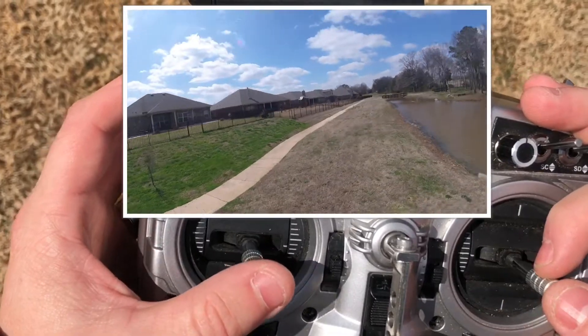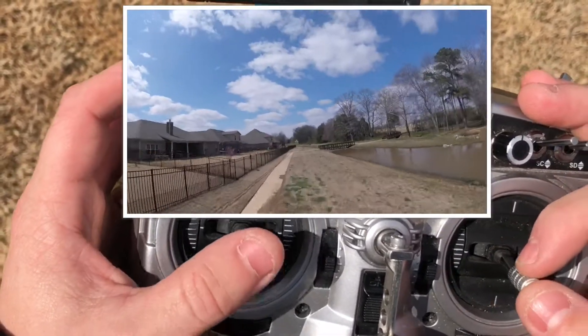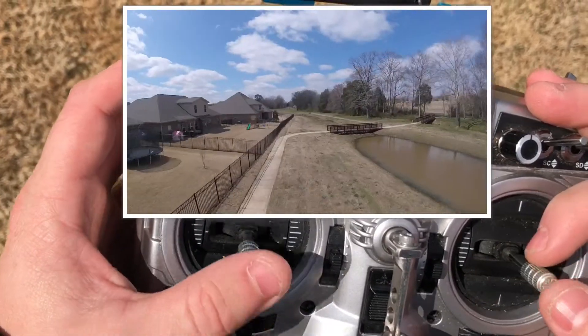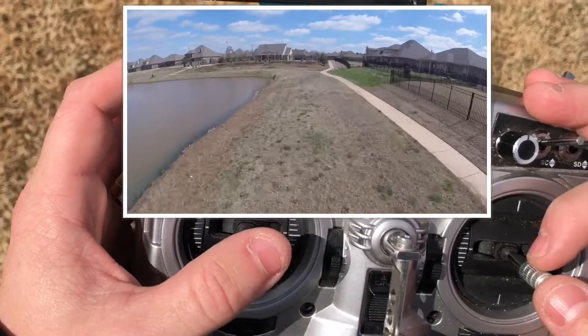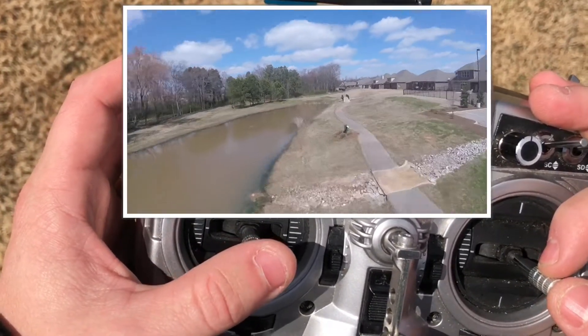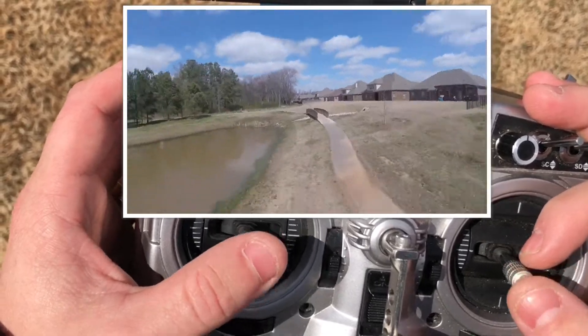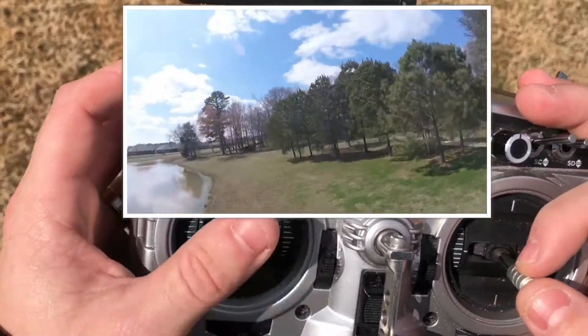D is like 20 and 22 on pitch and roll, very little roll, a little bit of bobble on pitch but it's not terrible. Steady flight, it is smooth, something feels slow. I should have put CPU load on the OSD but I don't see it.